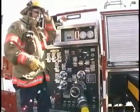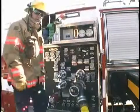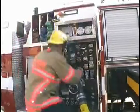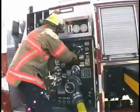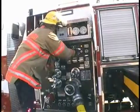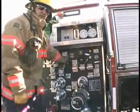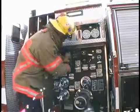Optimum is to have one person at the pedestal and one at the pump. For today's simulation, we're doing it in segments — we'll show you the pump panel operation and then transition to pedestal operations. We talked earlier about making sure your nozzle is in the correct position. I brought pressure up to 150 PSI for this operation today.